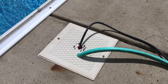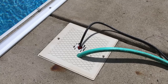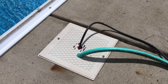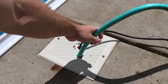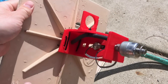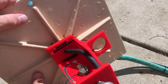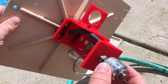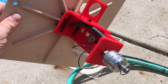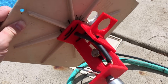This part is the brains of the operation behind the filling and the checking of the level in the pool. When the pump is off, we take a level reading inside the skimmer. I've pulled that hose out — this is a 3D printed bracket I designed using Fusion 360 and printed on my Wilson 2 printer, attached to a stainless steel level sensor from Automation Direct. I take a series of readings over a set period of time, and if the readings all agree with each other, I know it's time to fill. I fill at a certain interval, stop, then recheck to see if we need filling again.